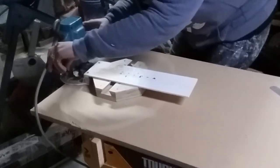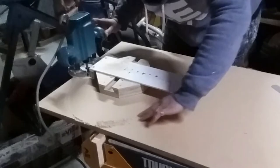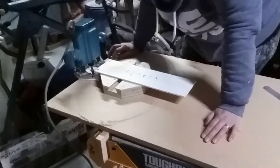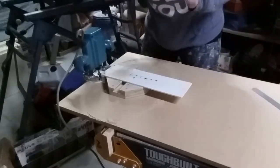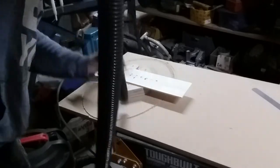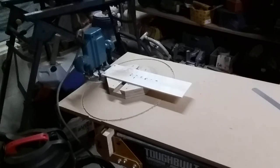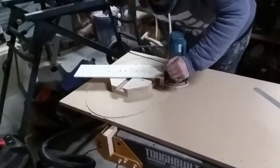I made it round once and as you can see, I left behind a filled-in gap — you can almost hardly see where I've cut. But hey, it worked! It went round in an oval! Clean up time. I got the vacuum out and went round and sucked out all that sawdust to make room to come round and do the next plunge and rotate. I went round about four to seven times, each time following behind with the vacuum cleaner. The vacuum cleaner got to eat lots and lots of MDF that day.